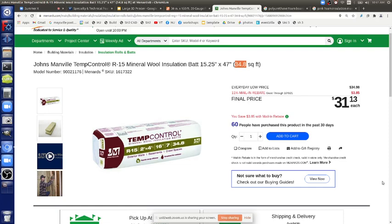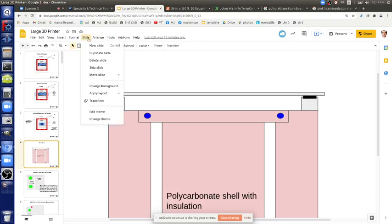So you're not gonna get that through, that's gonna insulate. How are you framing? Are we doing sheet, or are we framing? Sheet, how about, well, what do you think? So chicken wire on the inside? So you're insulating through that. I guess we could make it super simple. We could build the frame, staple on chicken wire, sandwich the insulation between that and another layer of chicken wire. So it's support, and then you just do literally just the outer legs. Like you don't have to frame in between.